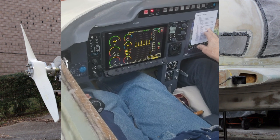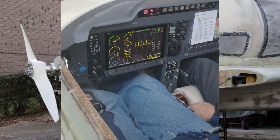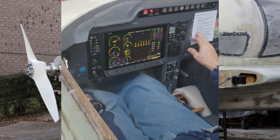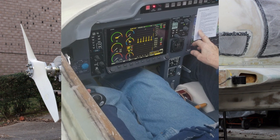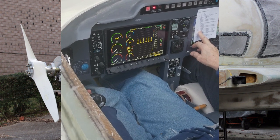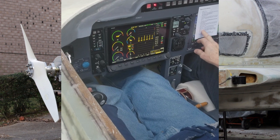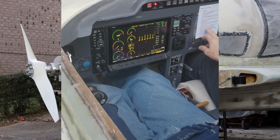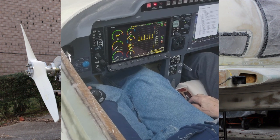Verify right fuel pump runs, we did, got good pressure when the ECU turned off, we can crank 10%, thereabouts. Key switch start for 5 seconds maximum or until engine starts. Engine fails to start, wait 15 seconds, check throttle position and try again. Clear the prop! You're good.